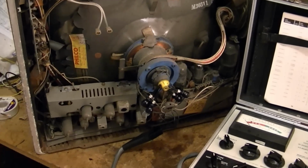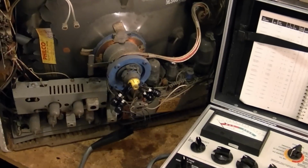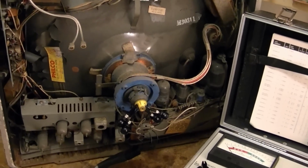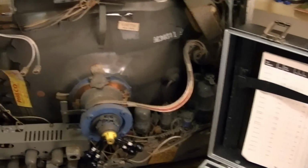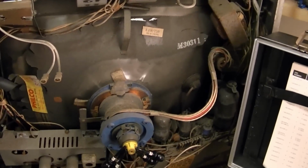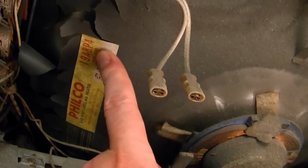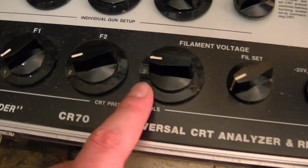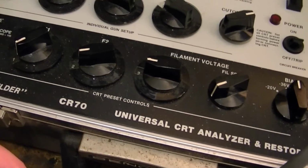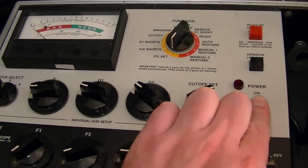I just found out that Autobahn5425 no longer has the Town & Country set, although he did save some knobs and some other bits. Of course, it's all a moot point if this picture tube is bad, because, as I suspected, these are rather uncommon sets. And even less common is a good 19ABP4 picture tube. But let's give it a shot. So I've got this set for low voltage down to the 2 volt range, because it's supposed to only be 2.68 volts. Let's see what happens.